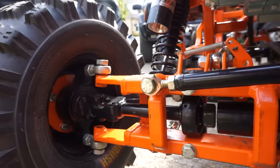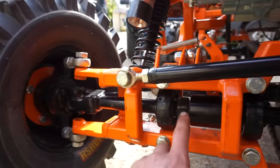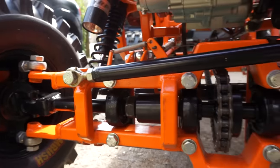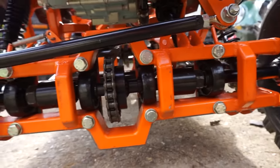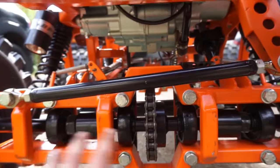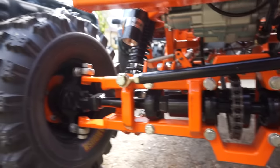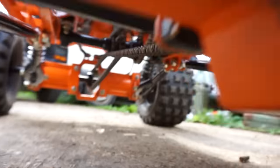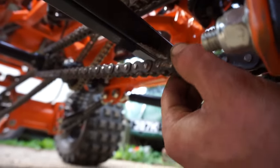And I don't quite know whether that's just flexing the chain, or it's skipping on the ground, or whether it's chattering backwards and forwards a little bit on this nut. But that doesn't seem to matter too much. Of course, it does when he's in two drive. It doesn't matter because he's completely disconnected, so the half shafts can float around at their own pace. But there's a bit of an issue under here with this steering member touching the chain.